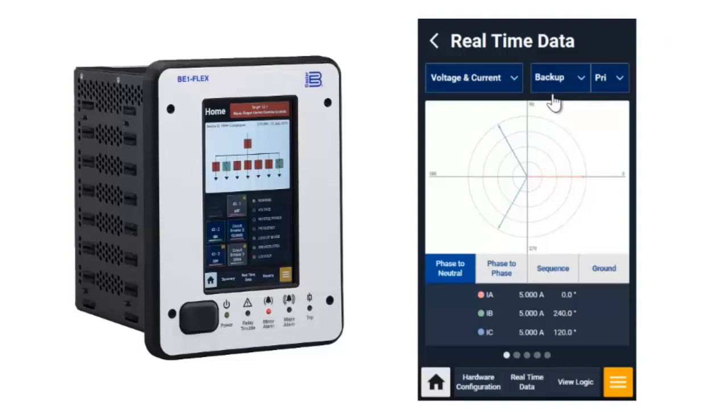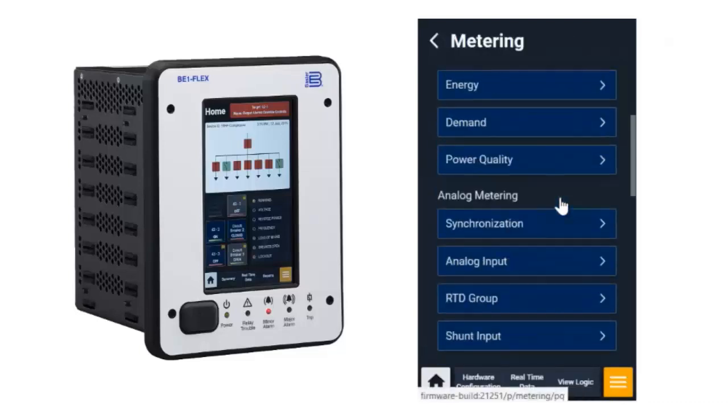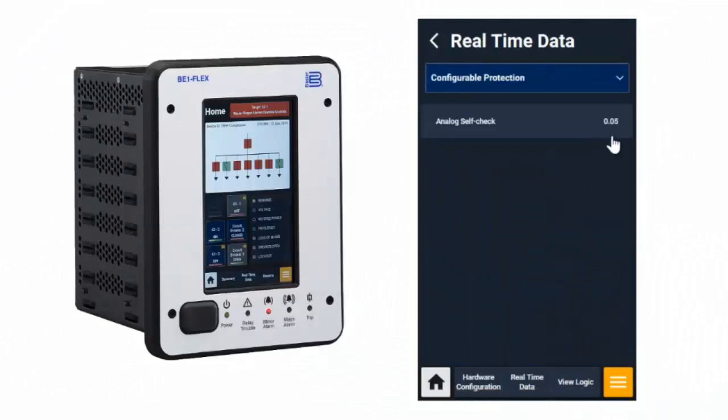So for my simulation, I'm going to do a ramp test, and I'm going to start ramping the backup circuit. So let's say hypothetically it starts to lose calibration, which doesn't really happen with digital products. More likely than not, if anything were to happen, a fuse would open or something would occur where it would drop out. But for this example, we wanted to show the sensitivity of it. We show the backup starting to ramp down, and if I jump to my configurable protection, I can even see that difference calculation moving in real time.